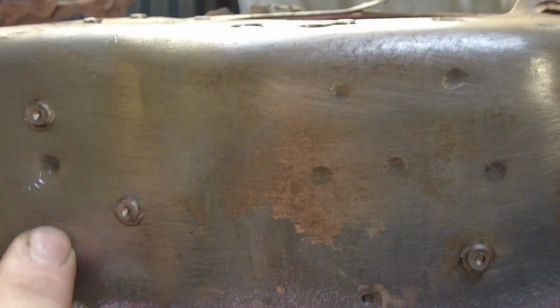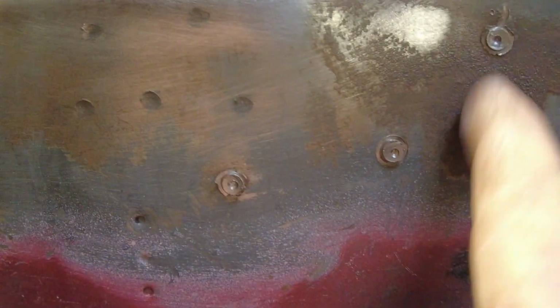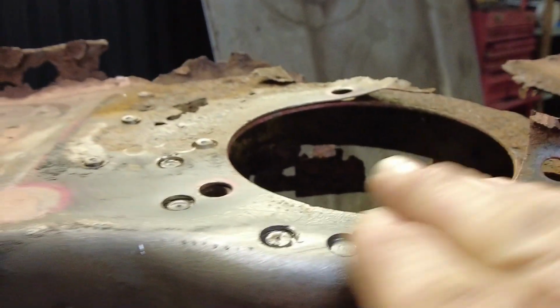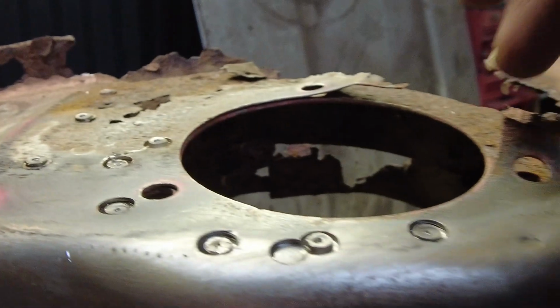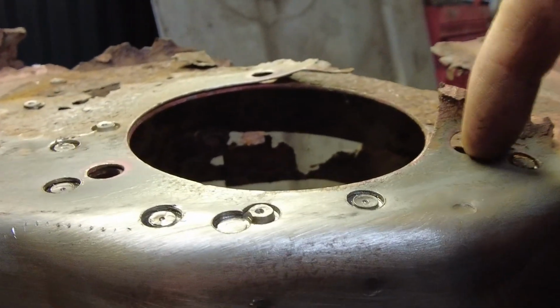Right, while they're wheeling that off, you see it has revealed the spot welds. So we've got a couple here. This is going to be for the reinforcement that goes down the inner wing. Same here. These here are the centre plate. Another one here on top. And I think that'll probably be about most of them, because I'm going to cut through here, get rid of all that really bad corrosion. Same here. Cut just below that hole.